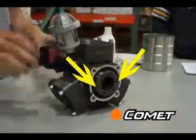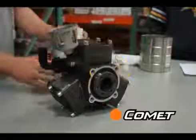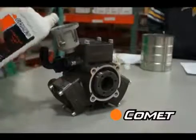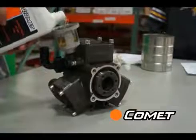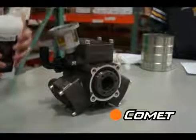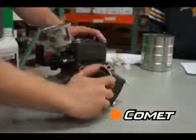You can insert two of the gearbox or shaft kit screws into the shaft to help with turning. Now pour fresh oil into the oil sight glass until it fills the oil cup about halfway. Then turn the shaft by hand while rocking the pump side to side — you will see air bubbles escape and the level will drop.